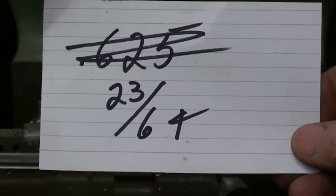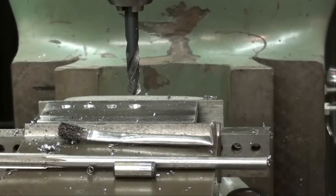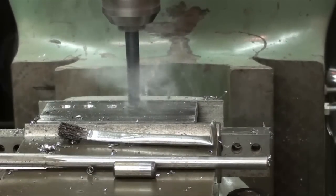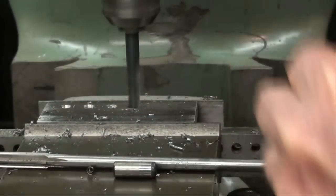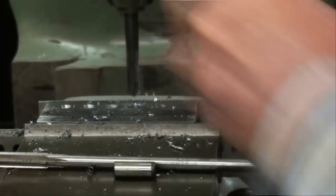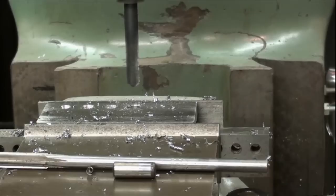All three are center drilled. Now I'm going to drill 23/64ths, which is one size under 3/8ths. I'm using a stubby bit — I like those stubby bits, they don't deflect. I zeroed out the DRO. I did take the parallel out of there so I don't drill into the parallel. I drilled one hole and I will drill the other three off camera, advancing it 5/8ths each time.